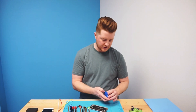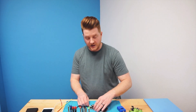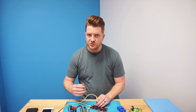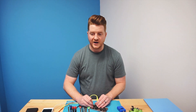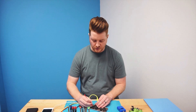Now we can go ahead and unplug it, plug in our charge cord, and unplug the battery to check at the battery FPC with a multimeter. We should get much more than the half a volt we got earlier. Testing it, we can see we're getting right at 3.7 volts, which is extremely awesome and the perfect result we want to get.